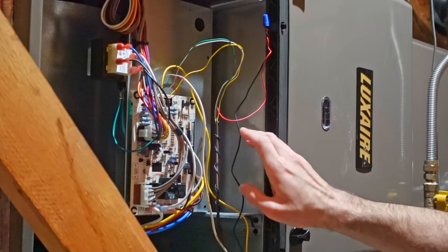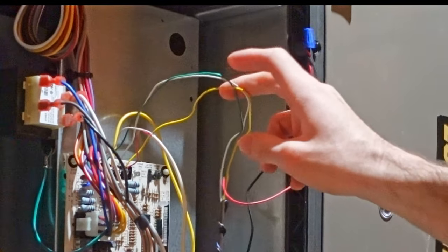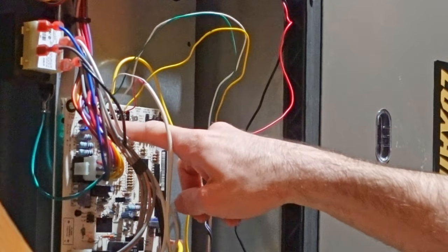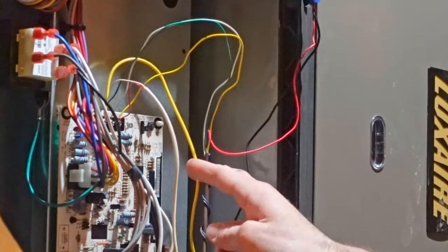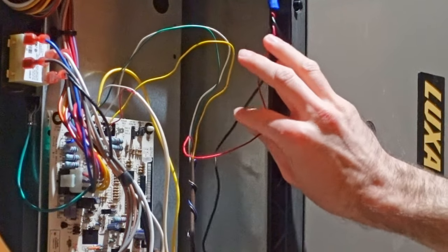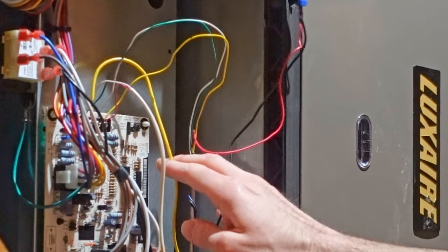I've removed the panel to access the electrical control panel on the furnace. First I need to identify my actual thermostat wires — this brown cable here — and I've got a yellow wire, a green, a white, and a red. Things are a little different on this one. I've got three wires going to the actual control panel hookups, five terminals, and my red wire instead of going to the R terminal is tied into a black wire which goes to a safety switch, which then ties into another safety switch. What you'll see is I have a thicker yellow wire which goes to my R terminal — this is still going to be my R wire for this purpose. I'm just going to be using this yellow and label it as my new R.